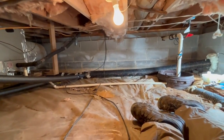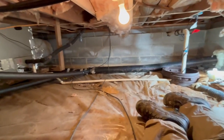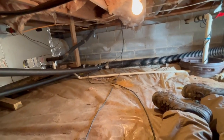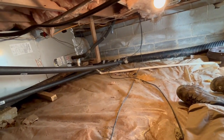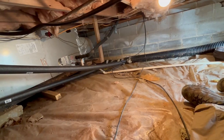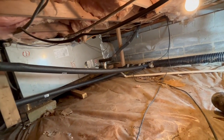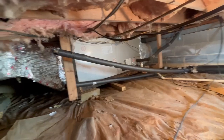Those are the lines in that four-inch flex pipe. There are two independently insulated lines that come from the wood furnace outside. One goes straight through to the water heater and then continues to the heat exchanger at the far end of the house, returns, comes up and through this heat exchanger, and then returns back to the furnace.